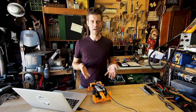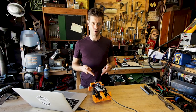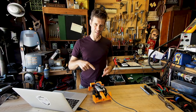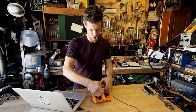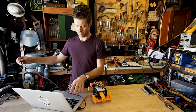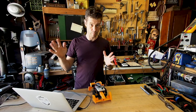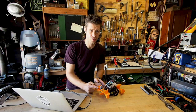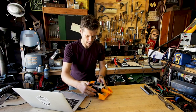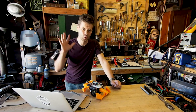This time I did what I had threatened to do before, which was control the car using humidity. So I've updated the software and I'm checking my serial port for humidity readings — I'm getting readings around 55 at a peak. Now with the humidity and temperature sensor here on the back, if I go ahead and blow on it, I should go over that value and that's when the motors will engage.